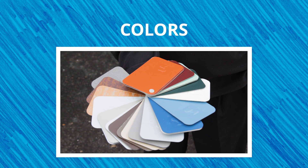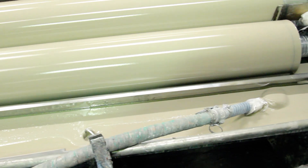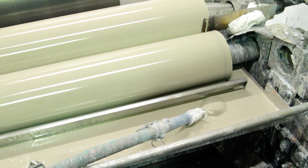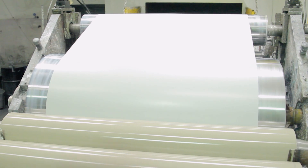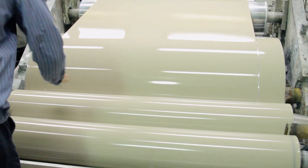What color will be used for the project? Make sure your client has confirmed what color they want to use and find out if the coil needs to be painted. As there are many color choices for metal roofing, there are different paint types you can utilize. Ask your coil supplier which paint type they use, how it stands up to certain weather conditions, and about warranties.